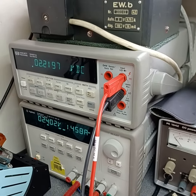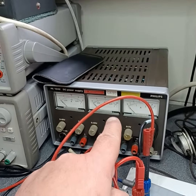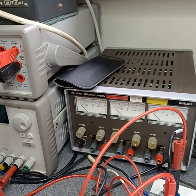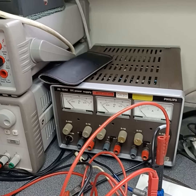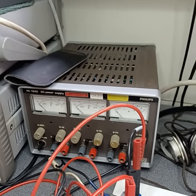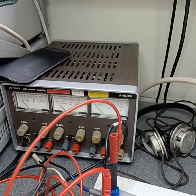Protection is important — you'd better have it. Because if you have a defect in your power supply, like I had in this one, with some cracking potentiometers — variable resistors that were a little bit crackly — I saw my output voltage going from 2.4 up to 2.6 or 2.7 volts, going up and down in a very fast way.